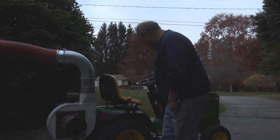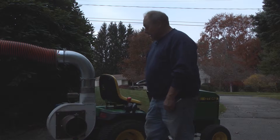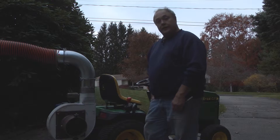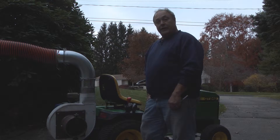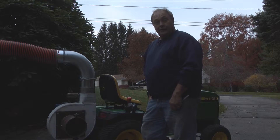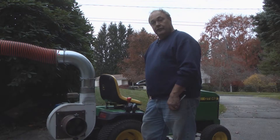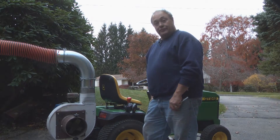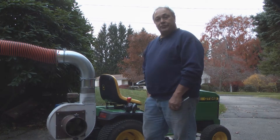It's doing the one process — the lawnmower is going to chop the leaves some, which reduces the volume. And then as it gets to the vacuum part of the system, there's actually two sets of blades inside. When I was thinking about making this, I decided that a counter-rotating blade — blades opposite the rotation of the impeller — would really do the job. So I tried to devise a way to make the first set or entry blades rotate opposite the impeller.